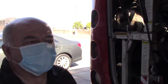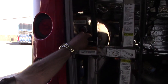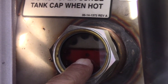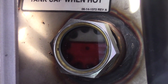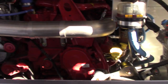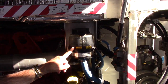Some of the locations of these items are quite different from every bus. For example, the coolant level is right here — versus other buses where there is a dot right in the middle of the side glass. As long as the coolant is above it, you have adequate coolant in the motor. The oil dipstick is located right here, generally it's yellow. The transmission dipstick is over here, and this is the power steering fluid.